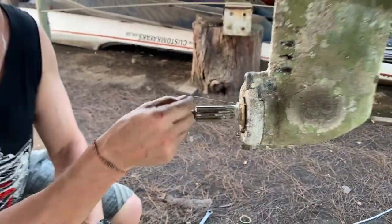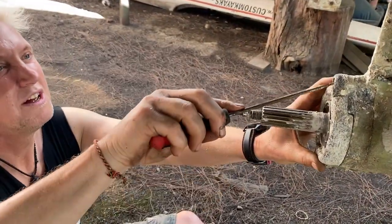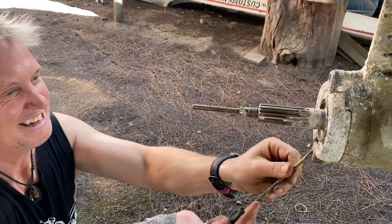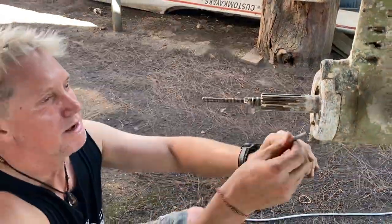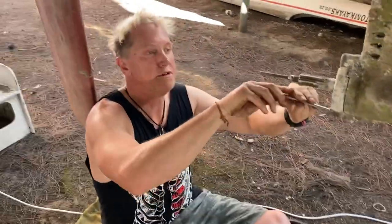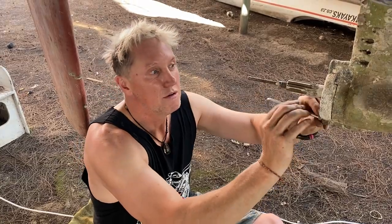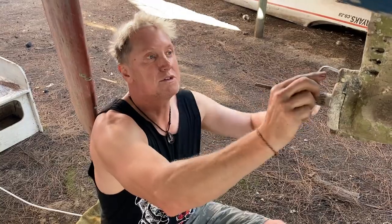We do find prop wrap in there. There's a hex nut there which is holding the sacrificial anode, and there's a lot of gunk in there. Very important that every time we change propellers or service sail drives, always replace your sacrificial anodes.